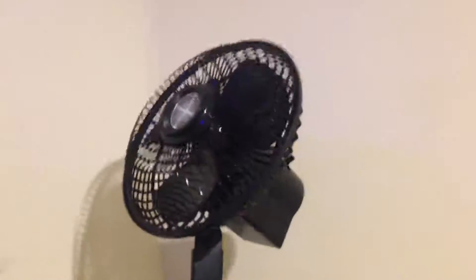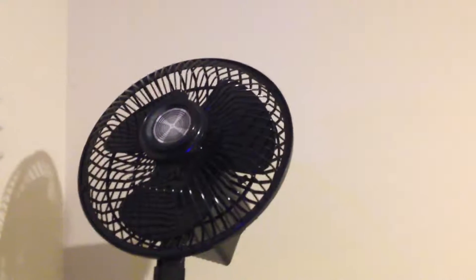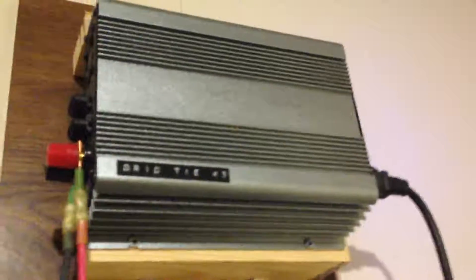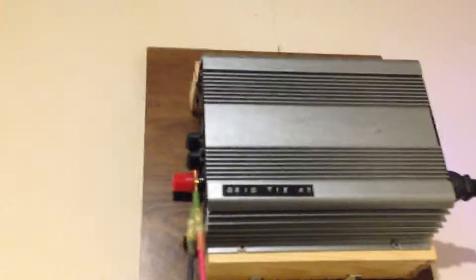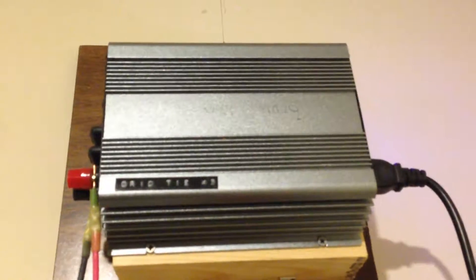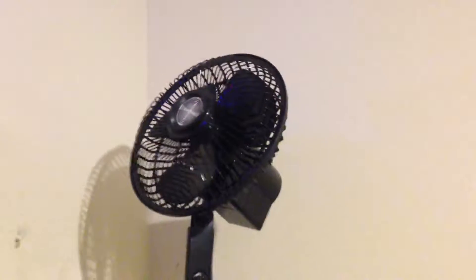This unit is cooled by an RV fan. You can see the blades — it pushes a decent amount of air across and through the unit, doing a very good job of cooling it off. Without this fan running, even at only 200–230 watts output with 400 watts coming in, this 500-watt grid tie inverter heats up fast. It's a simple RV fan you can get from Walmart — I just spliced it into a DC adapter from Radio Shack. Not pretty, but it works.